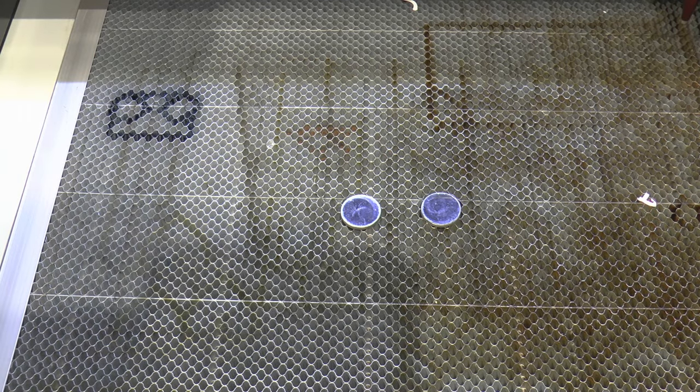We're currently looking into the light blade machine, and what you see there are the two molybdenum mirrors that are taken out of mirror number one and number two. Now, I've replaced mirror number one and number two with the gold mirrors, the copper mirrors that are supposedly gold plated. And what I've done is some tests which show me that I'm losing about 10% power across those two mirrors.